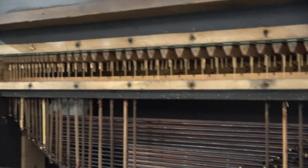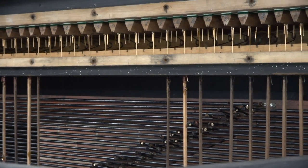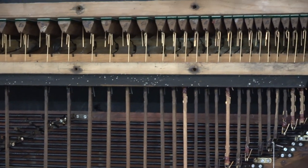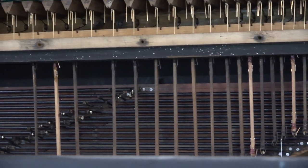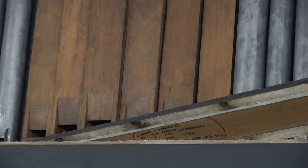I've taken the face board off so the pallets are exposed - that's just so I know we've got them closing properly. I did replace spring number seven from the right; that came from the wholesaler. It was a bit skew, trying to push the pallet to one side, and that was the one we were getting a whimper from. Hopefully that's gone. That concludes this part - we'll see you for more fun next week. Thanks for watching.